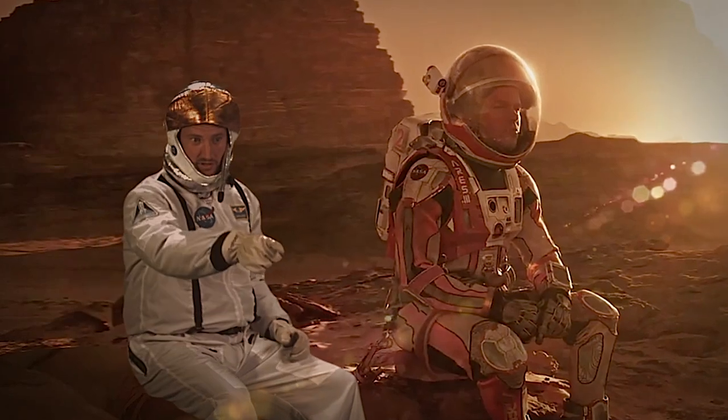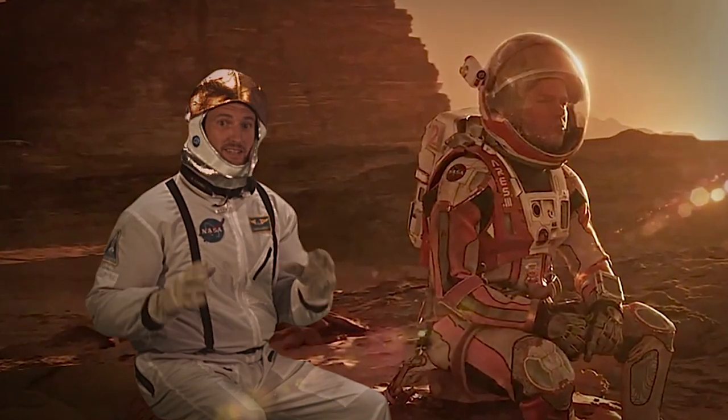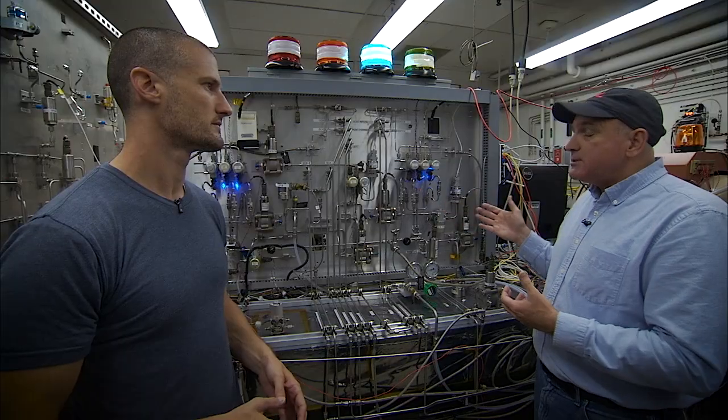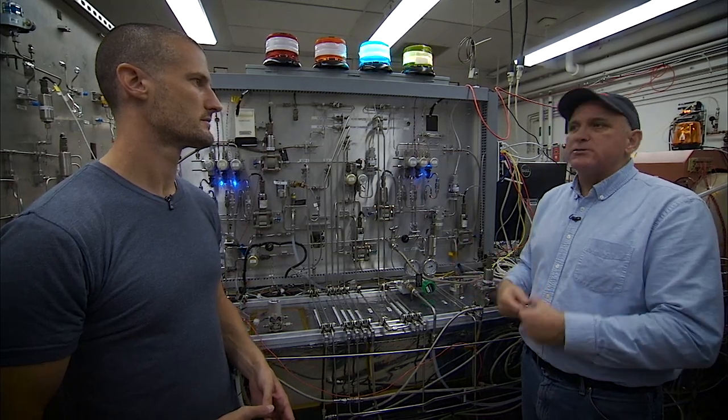What if we land on top of a mountain or down in a valley? The conditions for extracting oxygen are totally different. We've got to test for all of that. So the way we test for it is we design an instrumentation system that covers all of the conditions of the instrument — lower pressures, higher pressures, clogging filters, oxygen purity, all of that stuff.